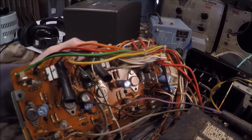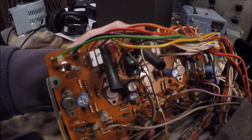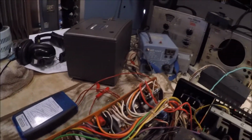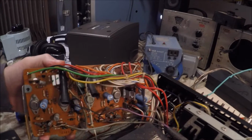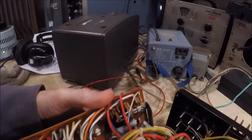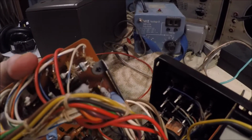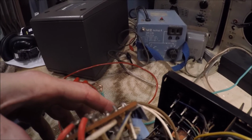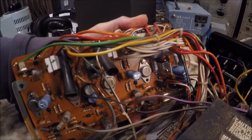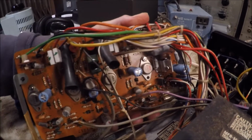And I've heard horror stories about a fuse problem being part of what's causing distortion. So I'm going to go ahead and check that, and then I'm going to heat up our desoldering iron, and we're going to get on the, I think, C708, 707. Those are the issues over here in some of my research with the 7065 Sonys. Those two capacitors and the C708.